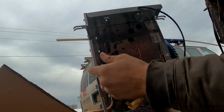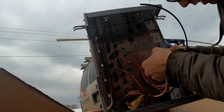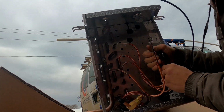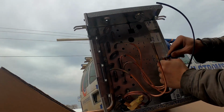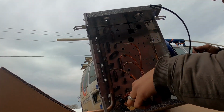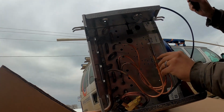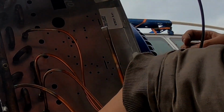And I typically leave that Schrader out till I'm done with the brazing on everything, including inside the building. And it's good to go kind of slow, because if you go too quickly on this, it'll cave it in enough that it's really hard to get your nozzle in there. And we're gonna have to widen that just a little bit. Typically just use a tool, something like this, and use it to ream that out just a little bit. Alright, there's our nozzle.